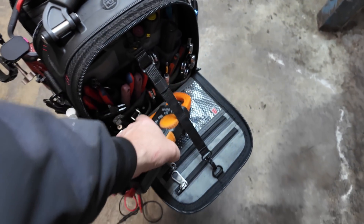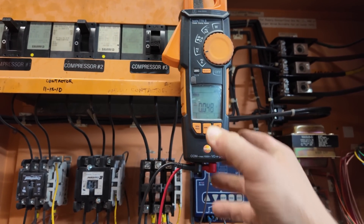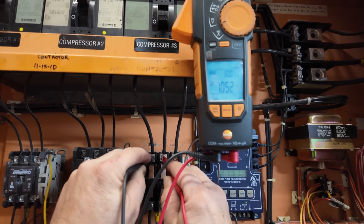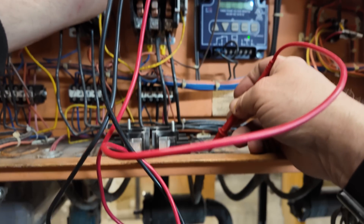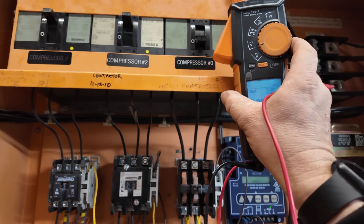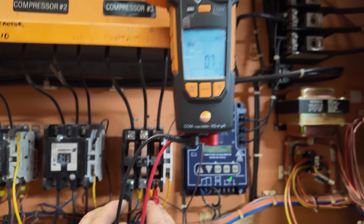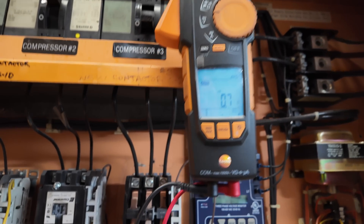The next thing I want to do is check my resistance on the actual compressor. We want to check our leads and make sure that we're actually zero ohms. We go leg to leg — we got really nothing. Once I've done it leg to leg, I go down to an actual good ground — three volts, which is really nothing. So the breaker is dead. Coming over to resistance, I want to check leg to leg: 0.7 there to there, 0.7 on 1 to 3, and 0.7 on 2 to 3.